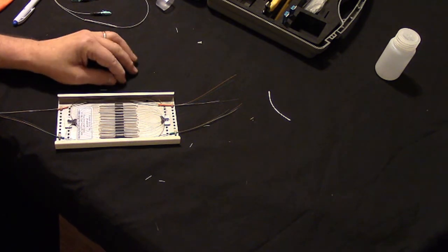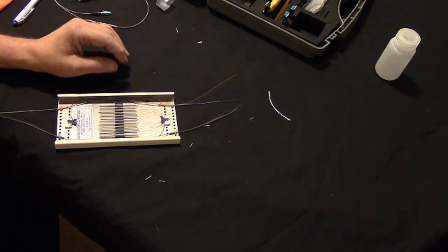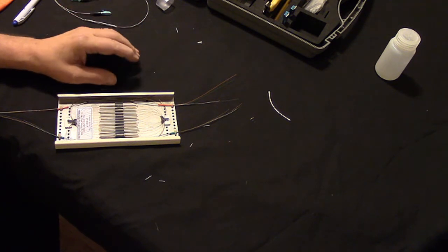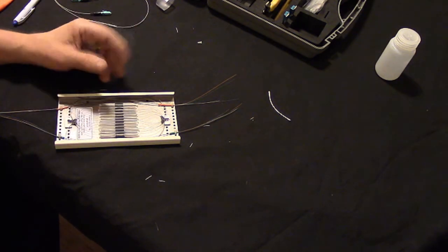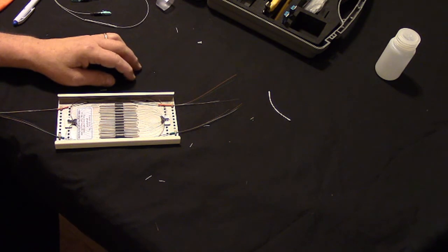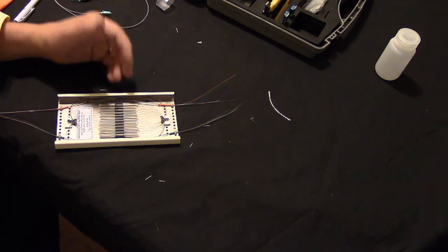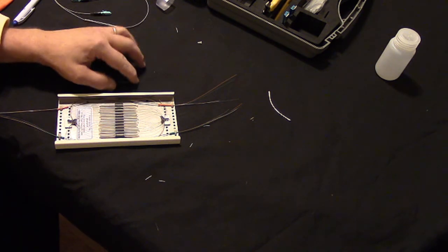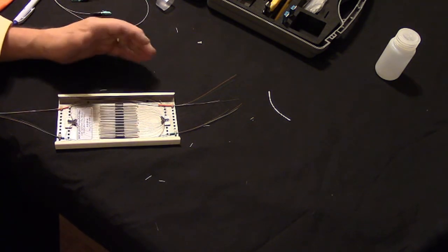When you're doing a repair to a fiber, whatever's going through the fiber is likely the most important data that the customer has, and the customer is going to want their fiber back up and running ASAP. So you go out there, and if you've got a fusion splicer and you know how to use it, you can quickly repair the fiber, and then if you have to tape it, I've wrapped them in garbage bags outside and put police tape around them, on sticks, do not touch this stuff. And then I told the customer, hey, we got to bury this later. Of course, I was doing it in the middle of winter. We couldn't dig because the ground was too cold. But the point is that you can do these temporarily, protect them in any possible way.